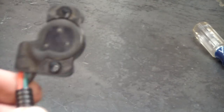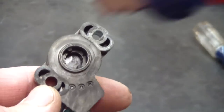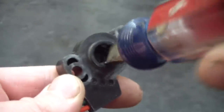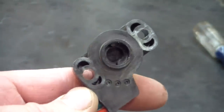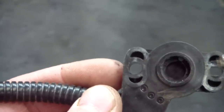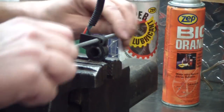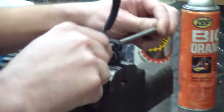Here it is removed — and here's the underside. As you can see it's actually spring loaded. So I'll go ahead and oval out those holes some. If I just follow my curvature here I'll be able to pivot it. I'm going to try to elongate this about 3/16ths of an inch and see how much adjustment I get out of it.